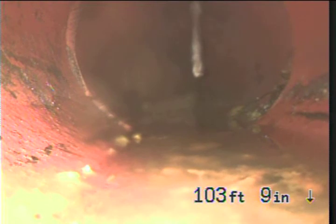You got to be getting pretty close to the city line. So there's probably a little root strand right in that joint. And it's catching some solids. And it's so far out that I can't push through, especially having gone around 180 degrees worth of turns. We are presently going to run some water, kind of push my camera a little easier maybe.